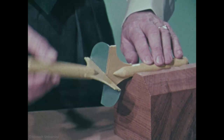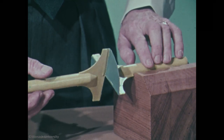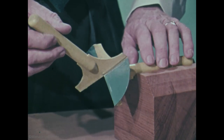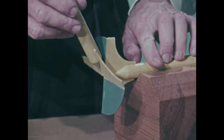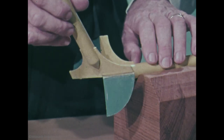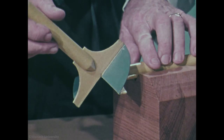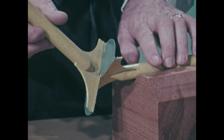Rotation about one hinge and rotation about the other. When the shafts are in line, they always rotate at exactly the same speed. But when they're angled to one another, the speed ratio is no longer always equal to one. It fluctuates through two cycles in each revolution, and the greater the angle, the greater the speed fluctuation and the more the wobble in the central plane. Because this plane wobbles, it is not a plane of symmetry. The theory shows that there must be a plane of symmetry that never wobbles at all if a coupling is to transmit exactly uniform speed between the shafts without any fluctuation whatever.